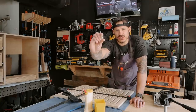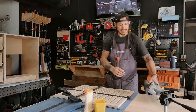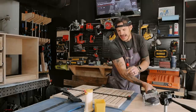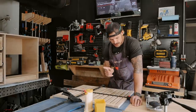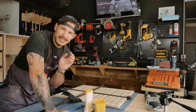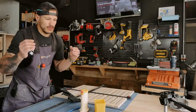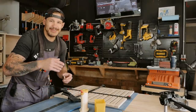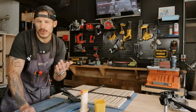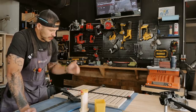Dominoes are just these little tiny wood chips. They create the idea of a mortise and tenon in a more expedited, quicker way — a domino is a gift sent from heaven. It quickly lines up, you press it in, and it creates the exact size hole to shove the domino into. If you don't have this tool, which is pretty pricey, alternative options are: number one, a dowel — a little tedious but totally doable; option two, pocket holes. On the back side of the door you'll see the pocket holes, so the solution is pocket hole plugs — a little wood glue, shove it in, once it dries shave it off and sand it. You have a bunch of different options. I have the domino, so I'm going to use that.